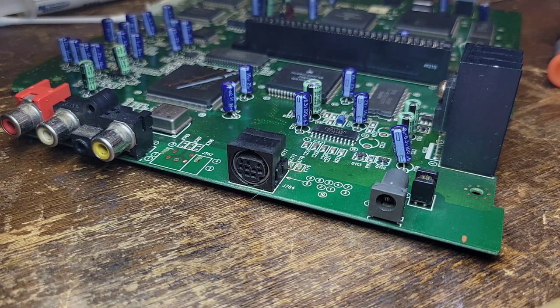Although it would be based on the crystal oscillator. So this one is 53 megahertz, 536931, and this one is 50. So yeah, they probably have that clocked down to 12. Am I wrong? Am I thinking that it's 12.5 and really it's only 12?